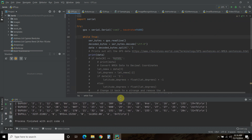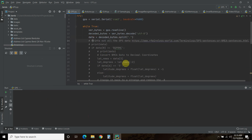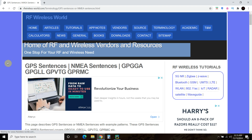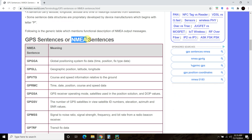What it's doing is printing out a list version of the information — the text information. These are the individual GPS data points that we're going to access. If you're not familiar with lists, this is index 0 or the first item, index 1 is the second item, and so on. These are called GPS sentences or NMEA sentences — the standard sentences for GPS receivers. Each block of data is referred to as a sentence, and they're parsed independently.